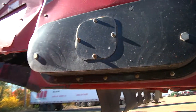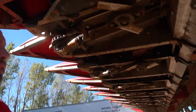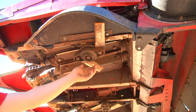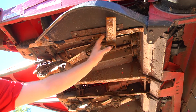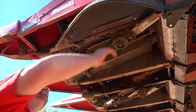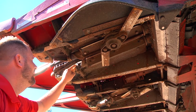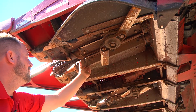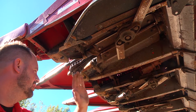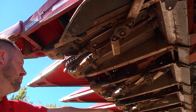As you can see, there's nice silicone underneath here. And then we get into our knives. We'll keep our distance as always. You got your knife rolls right here, and then you have an additional knife chopper — a chopping head. You want to make sure that they're free spinning, all the knives look good. Check where your bearings are, go up and down. Make sure you don't have a lot of free play, otherwise you're going to have to replace your bearings. Look down the row, make sure all your knives are clear and all the rubber is intact.